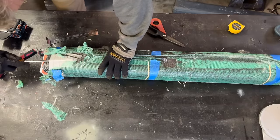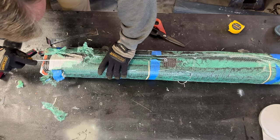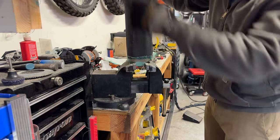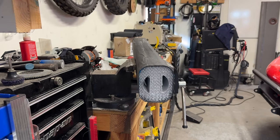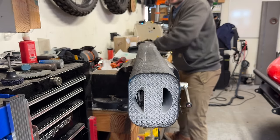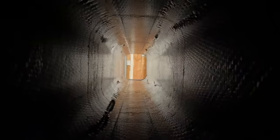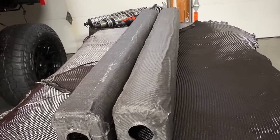The next day it was time to pull the part out. The outside was about the same as the previous part, except I forgot to leave a flange for the peel ply to start peeling from, so I had to peel it all the way down the length of the tube using a screwdriver. Thankfully, I don't care about the surface finish of this part. As for the inside — I beefed up the handle on this one hoping I could get the bottom to break free by wiggling it. Nope. Back to the fake sawzall. The cone on this one did not want to come out even more so than the last one. I'll spare you the details, but the mold did eventually come out with the help of about 40 minutes of violence and a bogus sawzall. And there it is — two parachute tubes, both taking way more time than they needed to, made in exactly the wrong material, ready to go on a land speed car.